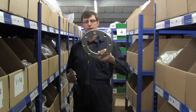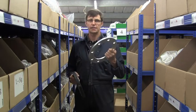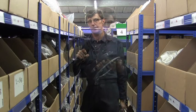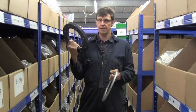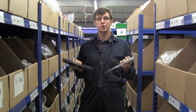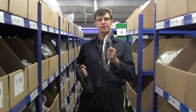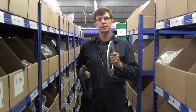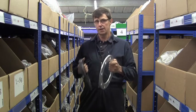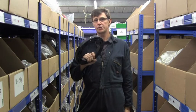Stainless steel ones are sometimes preferred for use in marine applications, but in such an application a PVC one is going to be just as good because that's not going to corrode either. For many people the choice between PVC or a galvanised backing ring is a matter of preference. Some people like to use a galvanised backing ring because they feel they can bolt it in tighter onto a pump or valve, but if you use the correct torque settings, a PVC backing ring is just as good.